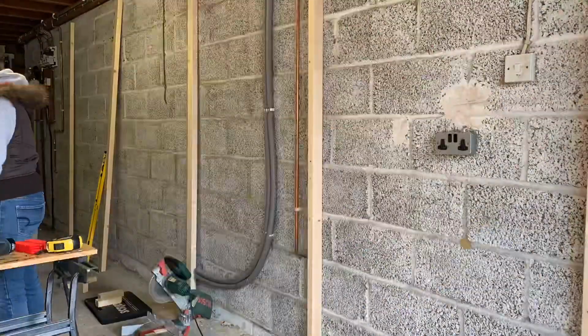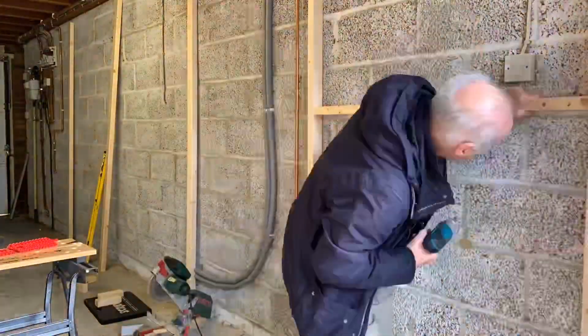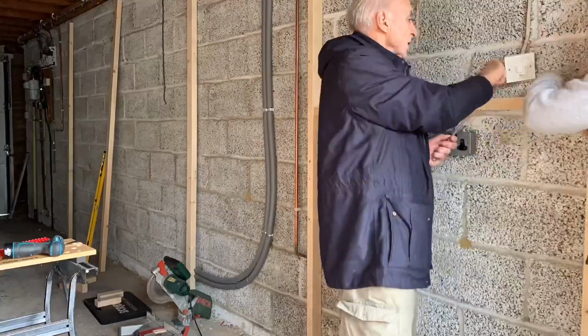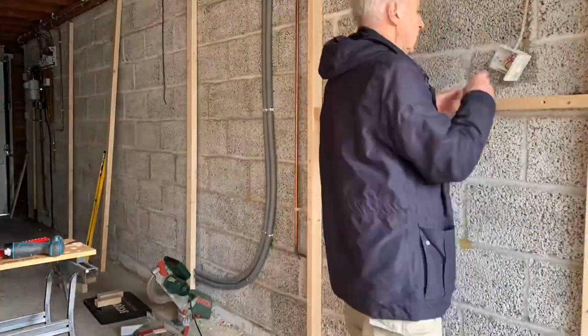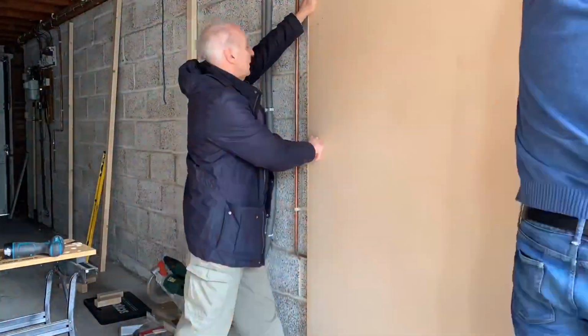So the first thing was to attach the battens to the brick walls. I've put a list of all the tools and materials we used in the description below in case it's of any use. We spaced them so that the boards would meet in the middle of the upright batten and added a batten at the bottom and middle of each section too.